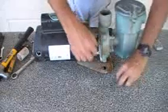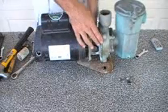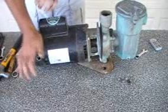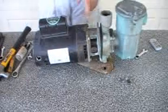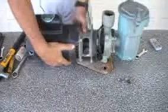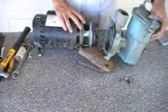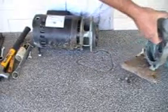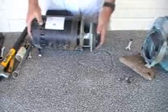Okay, we get our 4 bolts out. This is going to separate the adapter bracket from the volute. This I just pushed on it. Sometimes this is normally something we take and kick it with our foot right here, or maybe right here, just to be able to break it loose. This one was not bad at all. Now again, because this pump is not plumbed in, this is going to shift around on me, but that's not a problem. We're not working with this right now anyway.